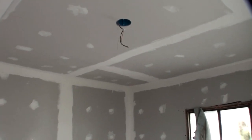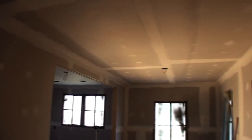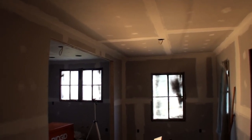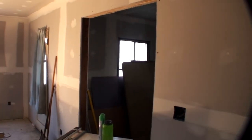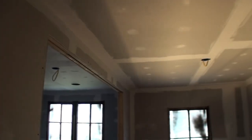For the priming and painting, all the ceilings and walls get primed with the same primer, then the ceilings get painted white and the walls will get some sort of off-white, ivory, or neutral color — not stark white but not a really bold color either. I'll apply all the primer and ceiling paint with my paint sprayer before the floors are finished. I can paint the whole house in an hour that way. Then for the wall color, I'll just roll it on to avoid having to mask off the ceilings.